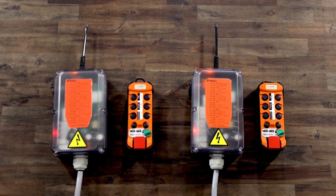By default, the AirMark radio automatically sets the primary paired receivers to the A LED and the secondary receiver to the B LED. In this configuration, you would have different naming for crane A and B depending on the transmitter. The next step is to do an A-B alignment. This ensures that the A and B LEDs indicate the correct crane on both transmitters. In this case, we will align the A-B naming on transmitter B to match transmitter A.